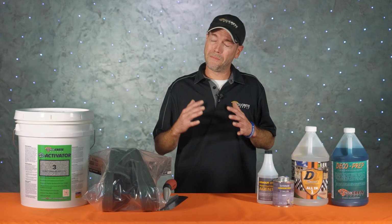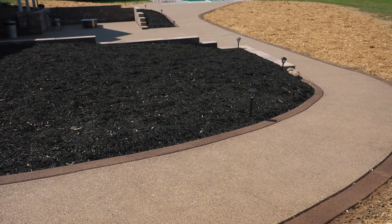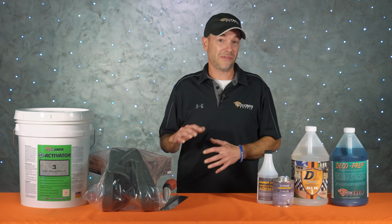Now, I'm personally a big fan of exposed aggregate concrete. I love the look and that non-slip finish that it creates. And you don't have to worry about that surface paste spalling off because there's no surface paste left. It's almost like the concrete is pre-aged, and the blemishes that appear over the years just don't seem to be as noticeable as they would on that perfectly finished broom slab. Now, you can also add integral color to the concrete for an even more impressive final outcome.